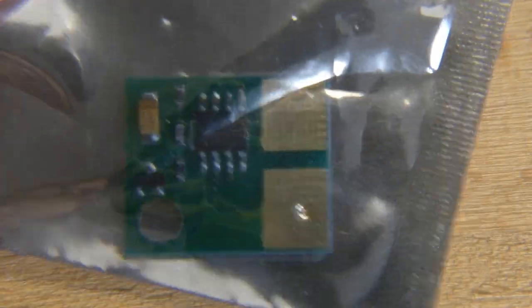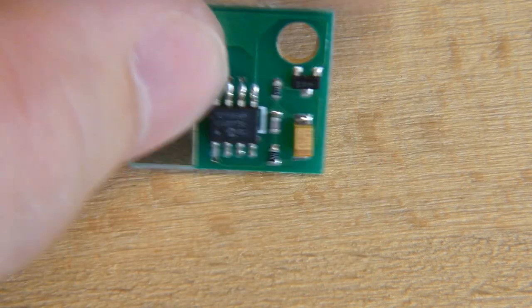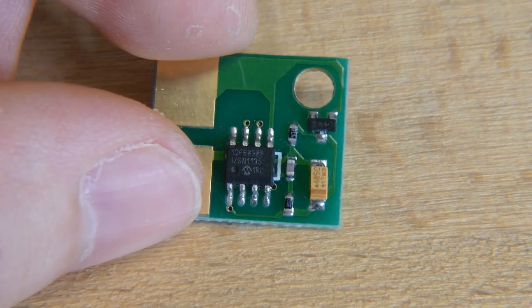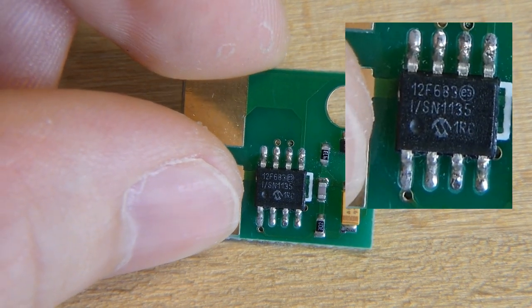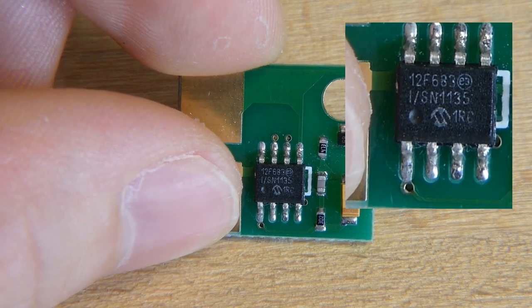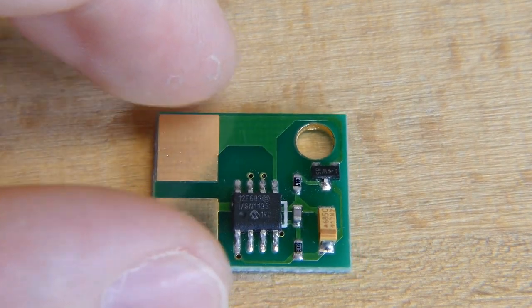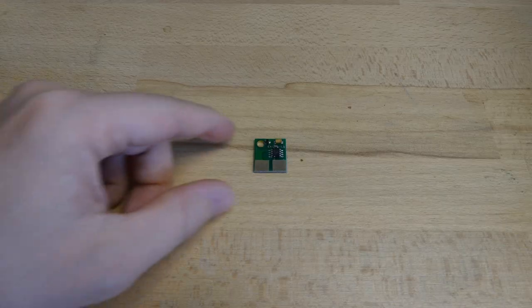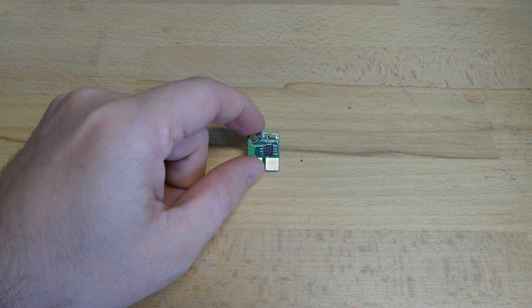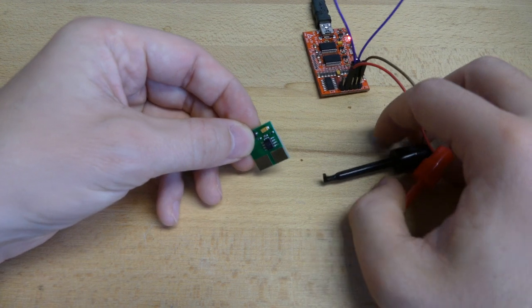Now I'm definitely not the only one having thought about this. This printer cartridge market is pretty juicy, and you can already find chips which do this. For example, this one. I got this one for $1.50, and this comes with a microcontroller. In this case, it's a Microchip PIC12F683, and they basically just redid what I did, re-implemented the one wire slave protocol and added a secret key to it. Let's find out if they implemented the DS2432 datasheet correctly and if they are protecting the secret.